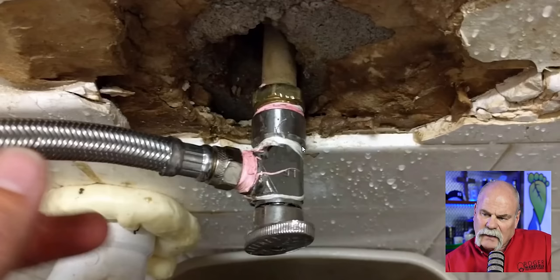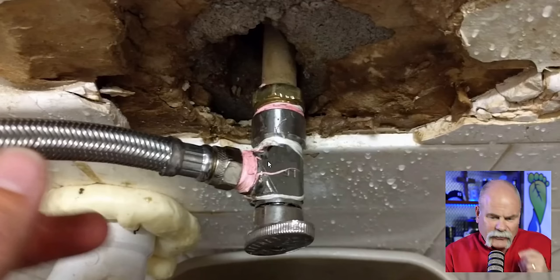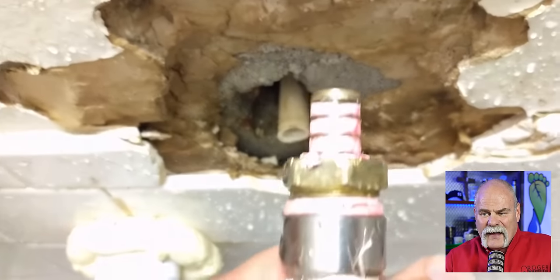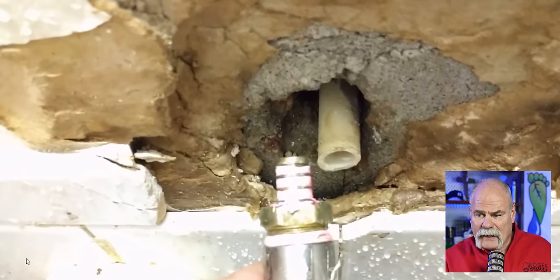Now this one's a video. When I first looked at this, I thought: you've got an angle stop with way too much Teflon tape on it — Teflon tape in multiple areas. You've got Teflon tape going down to your flex connector, which you should not need Teflon tape there. You've got Teflon tape back here, which may be right going onto a male adapter. Then you've got Teflon tape here and I'm wondering why — because there should be no threads. When he turns it, that is a crimping PEX adapter or something like that, screwed onto a stop and then stuck in there. I see no crimp ring, no stainless band, no clamp or expansion ring — just some kind of funky adapter stuck in there. I have no idea how long this has held or worked.